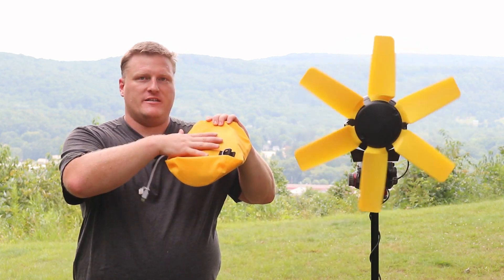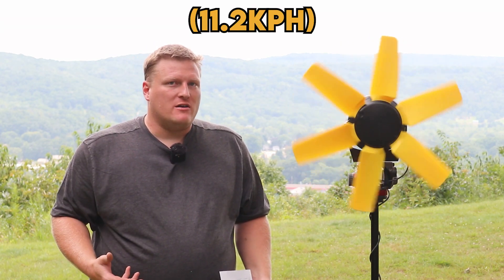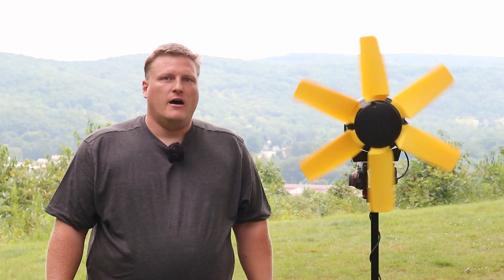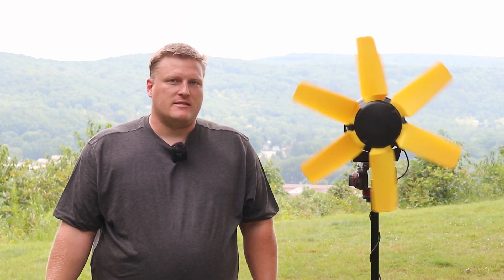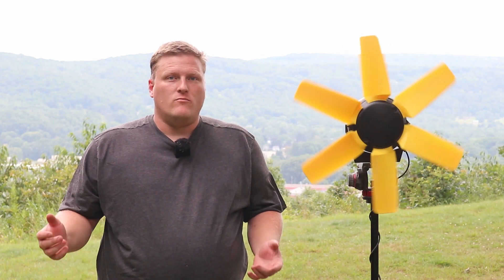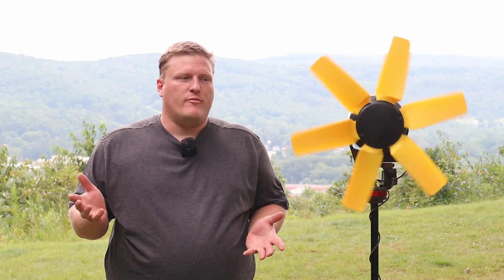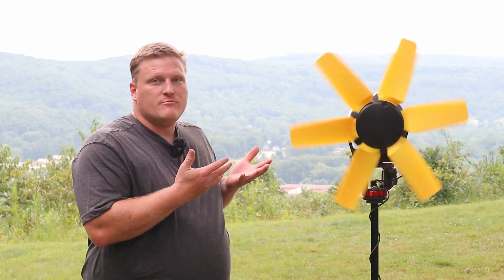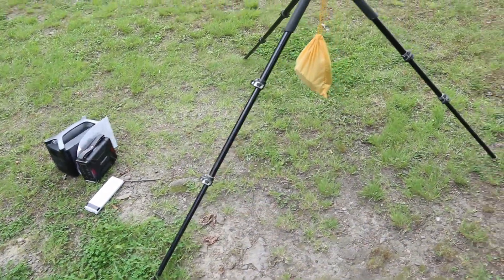You plug the bag into the turbine — though note this is a USB connection and I have a 12-volt turbine — and your charging devices can stay safe and dry inside. On performance: it starts outputting power at about 7 mph wind speed, does 15 watts at 16 mph, and 23 watts at 22 mph. The price is $254.99 with free shipping. This is made in Canada. Would I buy this? The answer is no, but I'm not the customer for this — I don't do a lot of camping and traveling. If you do those sorts of things, this might be an excellent solution for you.